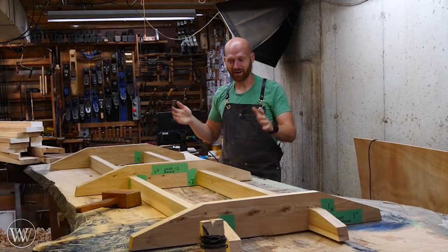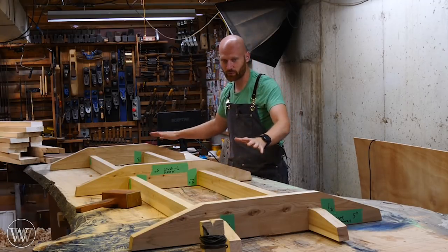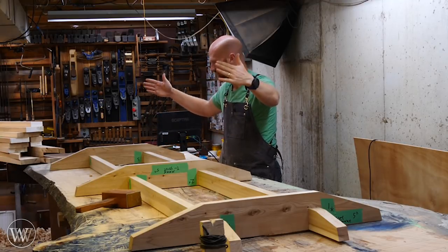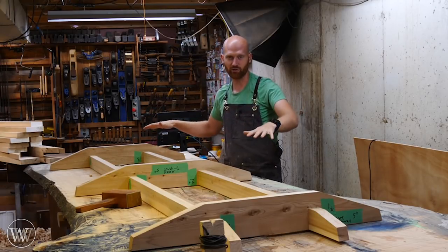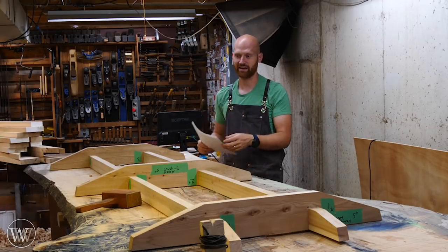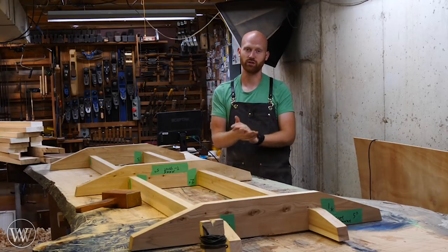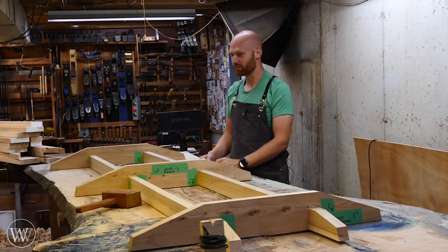Hey, y'all. I'm James Wright, and welcome to my shop. We are working on the dining room table again, and we finally have the base starting to come to life. You can see how it's upside down right now — we'll be building the structure upside down and then taking it upstairs and flipping it. Today we're going to be working on the rails, these long pieces that go end to end, and then the stretchers or stiles that connect the rails together. This will be what actually supports the whole weight. If you want to follow along, I have plans on my website with all the measurements and details. Thank you to those who have purchased them already — you are making Wood by Right what it is today. I don't have any sponsorships, so I'm completely supported by you when you purchase t-shirts, card scrapers, and plans. Let's dive into the project.